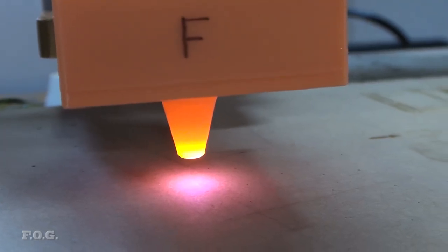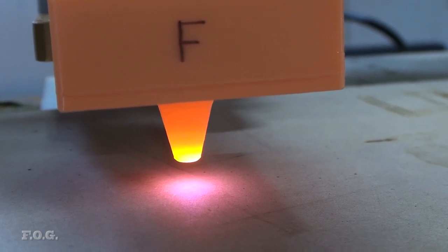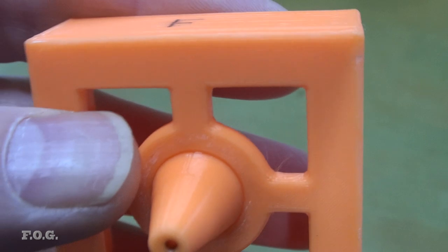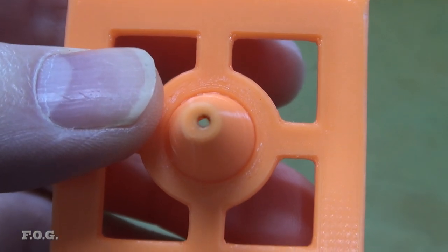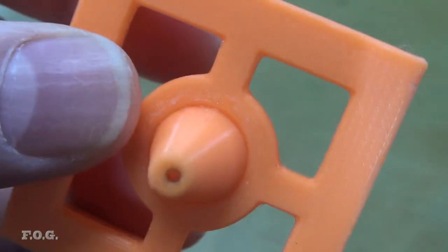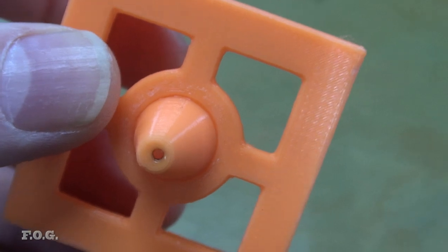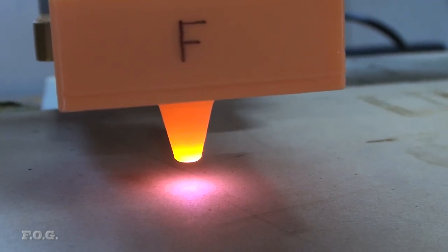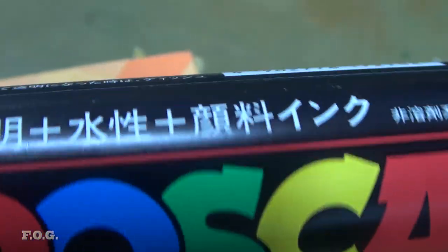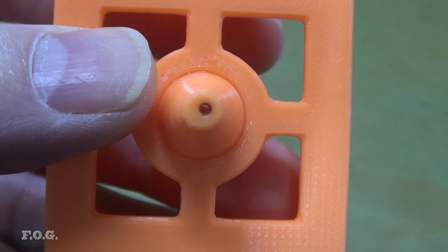When it comes off the printer, the laser hole is intentionally blocked—the hole is burnt by the laser itself to ensure exact alignment with the smallest possible opening. Unfortunately I messed up burning this one and it ended up oversized, because char builds up around the inside edge. Once you clean off the char, the hole is bigger than needed. The filament I chose was also not ideal—this orange stuff is very translucent. I used a paint pen to help, but it's still not really ideal. For the next PCB I'll make a new blinder in more opaque filament and take more care burning the hole.